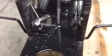I've also built my battery mount. I'm not a big fan of bungee cords, so I take a piece of rod, bend it, and weld it right there. Then I weld a tang with a hole in it, use a J-hook, and it comes across the top of the battery and tightens down — holds it in place nice and easy. I came up with that on some of my other machines and it worked well.